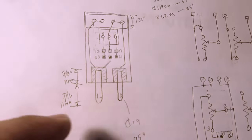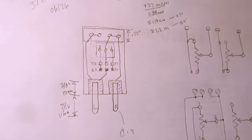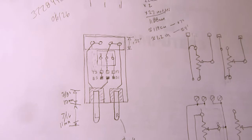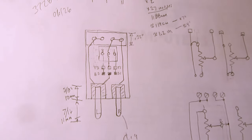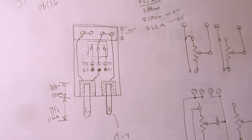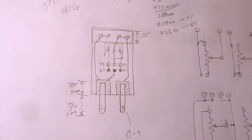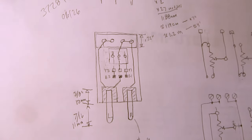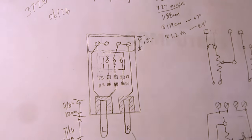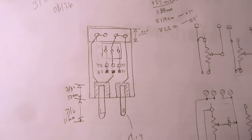And I could increase that by painting over that area of the circuit board on the side with the foils. I have more spacing with just the pads, but the foils cut into that a little bit. I can paint over with an insulating liquid, which when dried will act like a silk screen, or a solder mask more specifically, and that would increase the dielectric of that even some more. So it should be good.